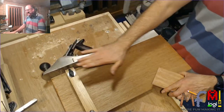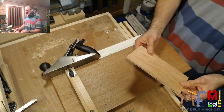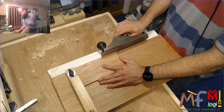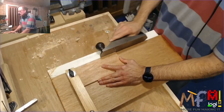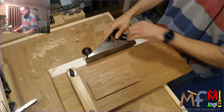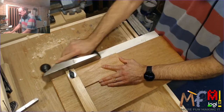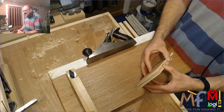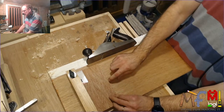I love planes, hand planes, and especially my shooting board. It's a fairly recent addition to my tool set. So I know that square, that square, and that square, but I don't know about this edge, so I'll just... Which is not square. I've got candle wax here, a little bit of lubrication. There we go. I need to sharpen this. This is actually getting a bit dull. That'll do. Still the same width. I've hardly taken anything off. Actually, it's not. The bottom one is a little bit.